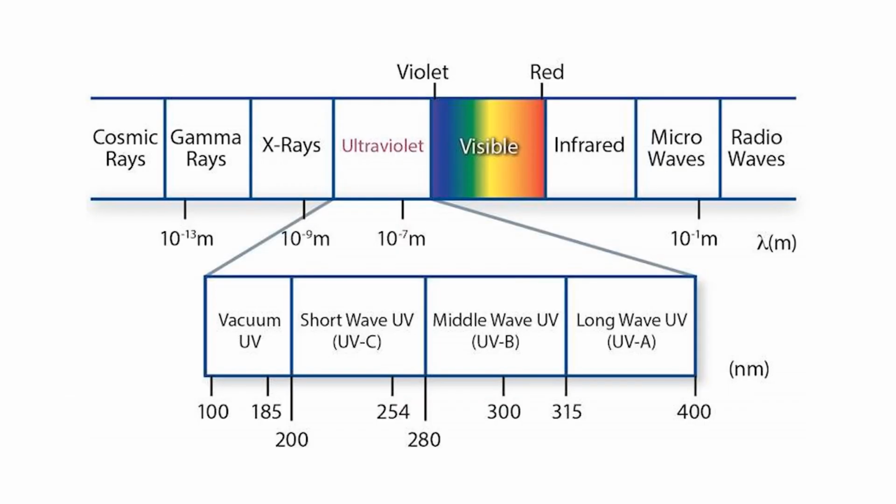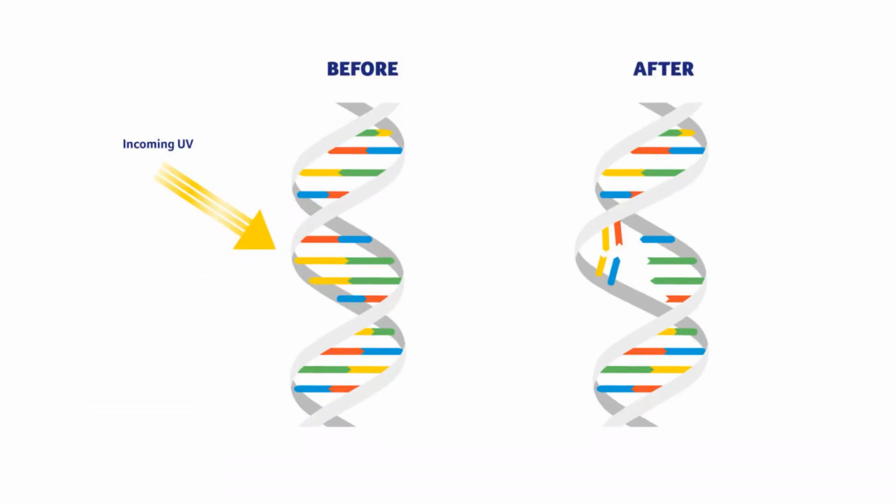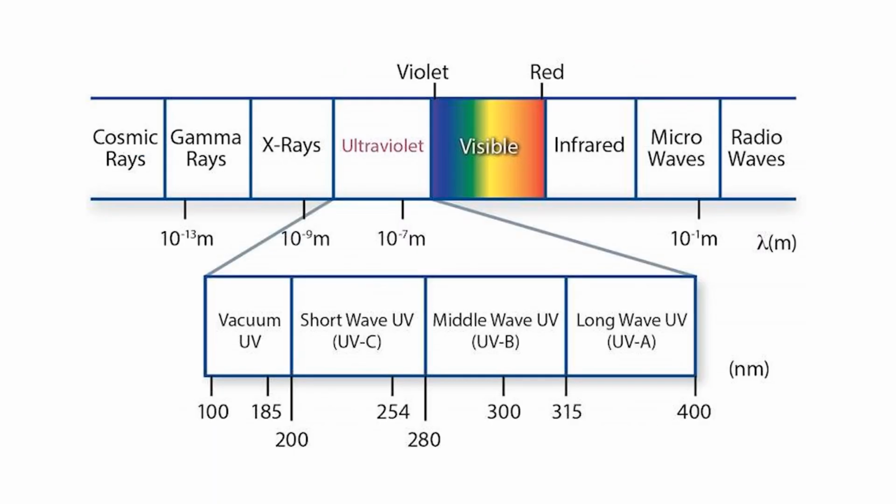But how does a UVC bulb kill microbes? UVC is a range of wavelengths of light which could be used to kill microbes. It kills microbes by damaging its genetic material, making it unable to infect or spread. Unlike visible light, UVC has a shorter wavelength, making it much more energy dense. In fact, UVC is even more energy dense than the UVA and UVB light that comes from regular black lights or sunlight outside. This increased energy makes it very useful for killing microbes such as viruses, bacteria, or mold.